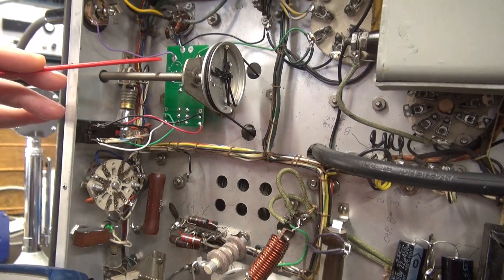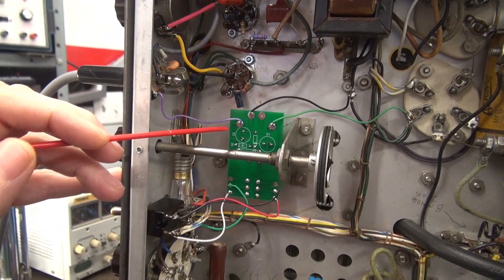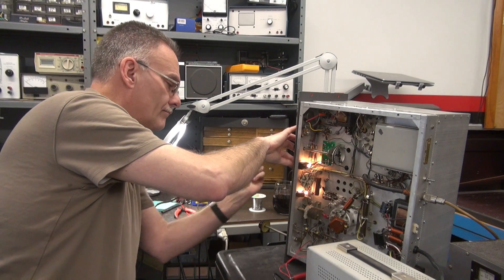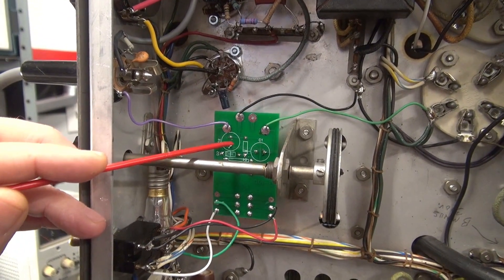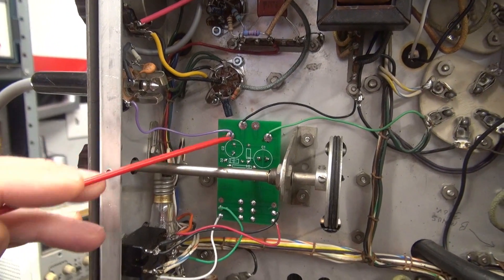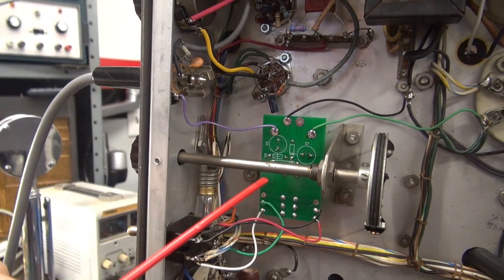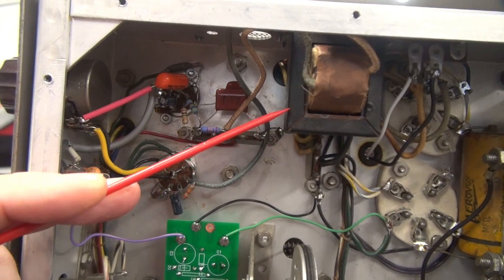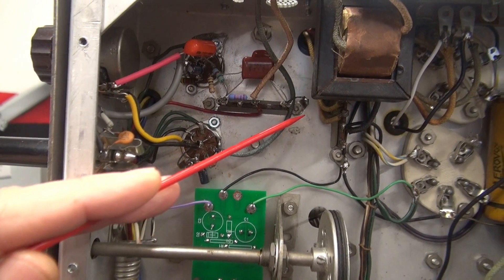I thought, how could I possibly have arcing on this board when it's only running at 12 volts DC? Maybe it's reflection. I reviewed the video — you can see the flashing on this pad right here, and this pad in this configuration is not even used, so I thought it can't be arcing, but something could be reflecting on it. Maybe it's the push-to-talk lamp reflecting, but it was cutting on and off not at the same timing as the plate lamp. Over here is the interstage transformer, and underneath that is the terminal board where the modulation transformer is connected.